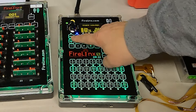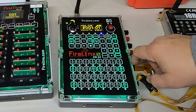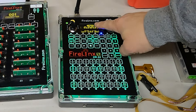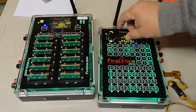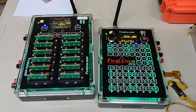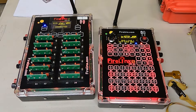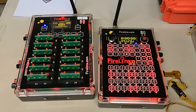Now once it's loaded, I'll go into the menu and tell it what command to use for running the script — this time we're going to use the internal clock rather than SMPTE. We can turn the key to put it into ARM, and there's also a separate ARM button. You can see that both the command module and the field module start flashing red. With a press of the red fire button, we'll start the script.